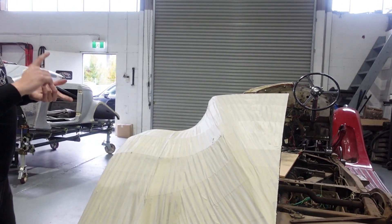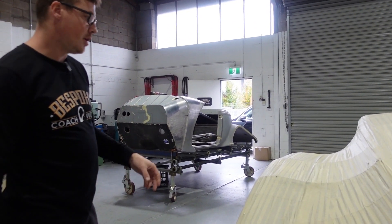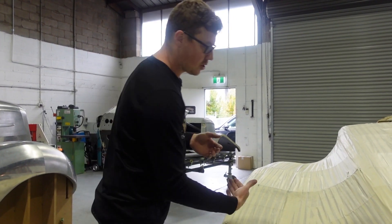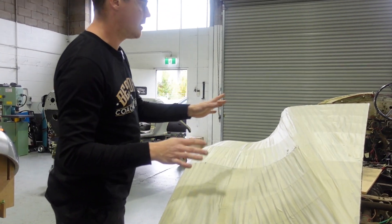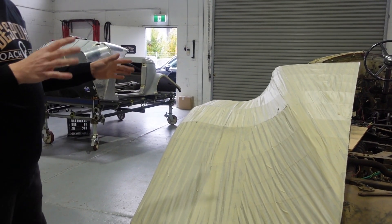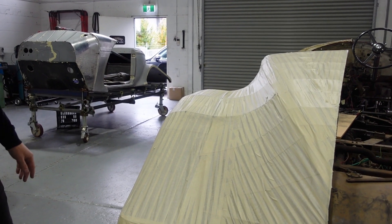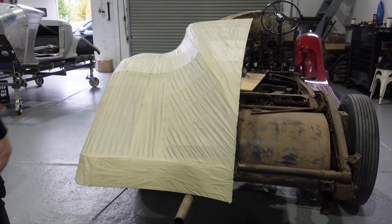All that's done in like an 8mm or a 6mm wire — a bigger, heavier gauge. From then I've just used 3.2 millimeter TIG wire to try and just lay reverse profiles through all of this space, just to give me the shape so I can visualize what's happening. I've just got tape on there at the moment — it sort of fills in the space so you're not looking through and seeing all the chassis and all that sort of stuff.